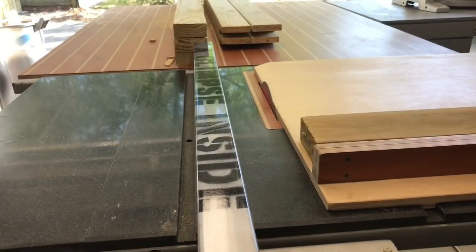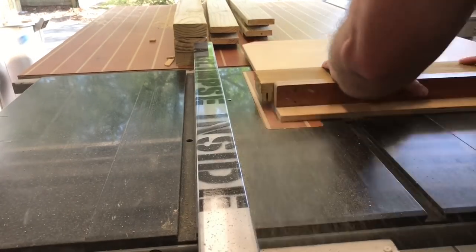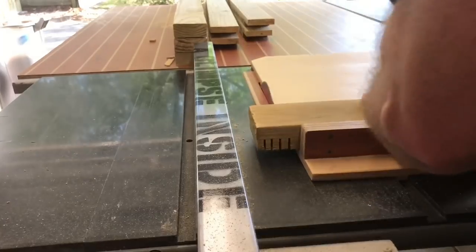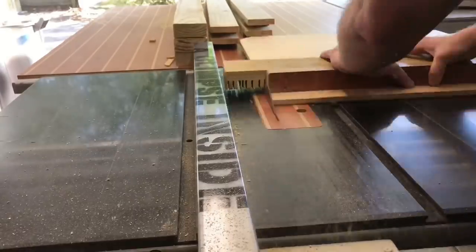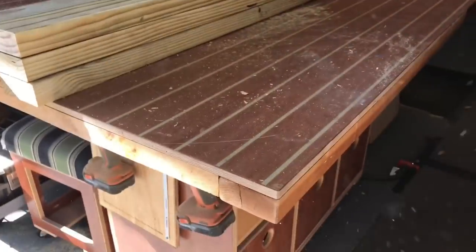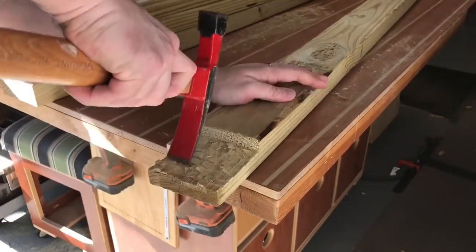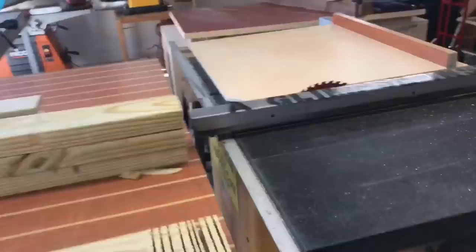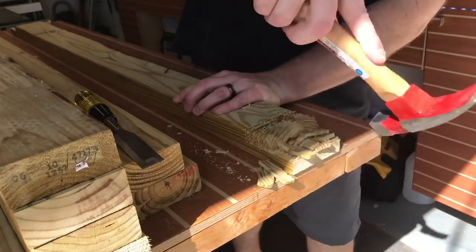Now I'm making my way inside the shop to start constructing the gate. What I'm doing here is making a series of cuts with my panel cutting jig. Eventually I'm going to make a half-lap joint, taking off exactly half of the material of each 2x4 on each end, then knocking out the waste with a hammer. To get it flush, one way is the easy way — I take a little random orbit sander, and that worked out pretty well.